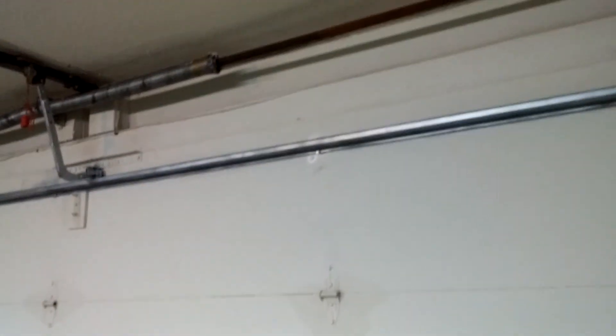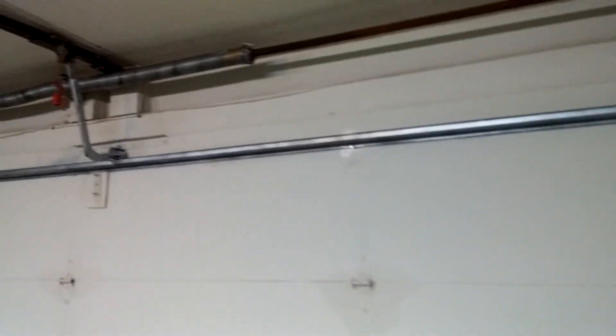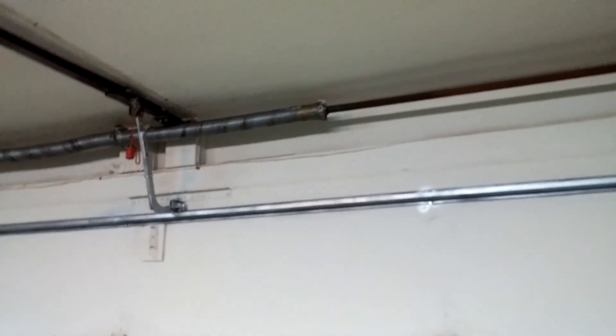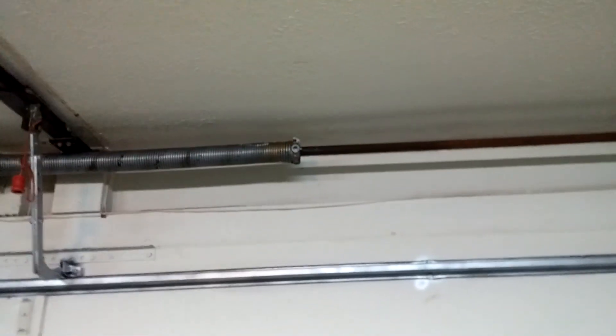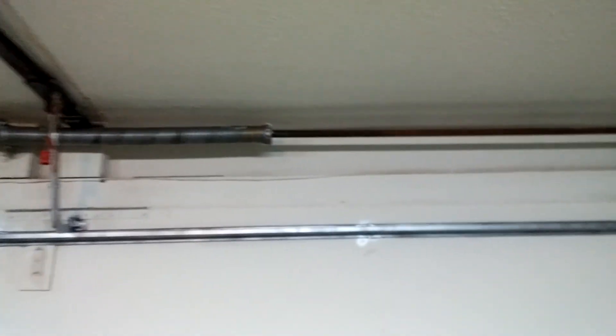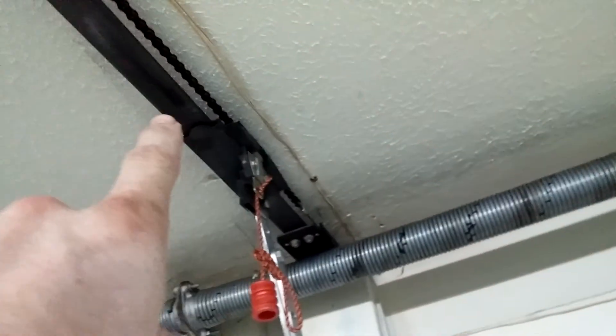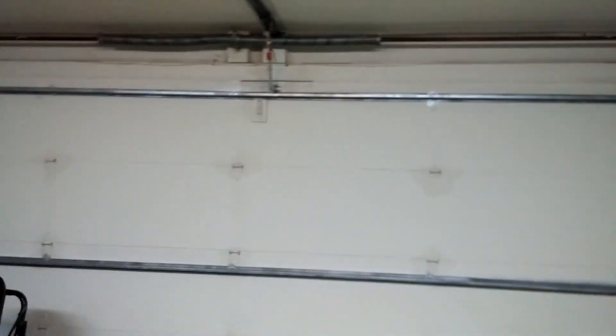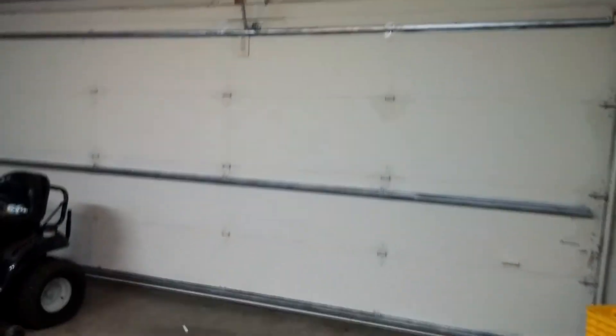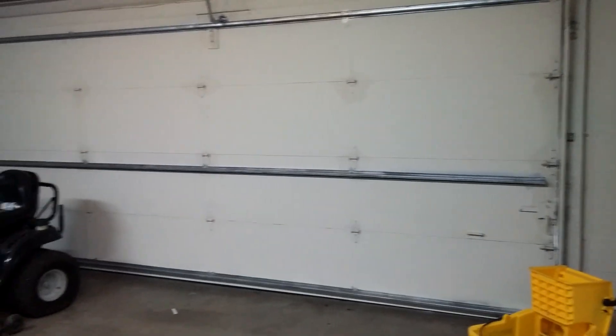The main reason I made this video: I found out today about this garage door. If you have a wood garage door like this one, do be careful when you detach it from the opener. Because this one is bound a little too tight — very tight. This door flies up real fast. The door was actually moving faster and pushing the trolley against the opener arm. When I let the door go by accident, it flew back and hit the motor. It did not break the motor or the unit, but I have to have someone come look at this door, because this door is very dangerous. I gotta get this door adjusted properly.